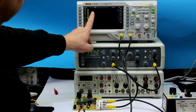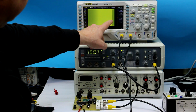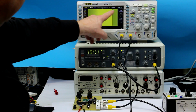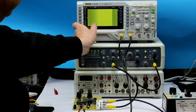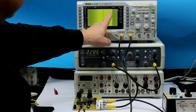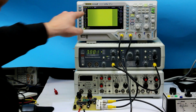And so now I've set the horizontal time to 1 second per division and put the trigger point just to the left so that we have 12 seconds. And of course now you can only see just the peak level of our frequency, because the sine signal is of course compressed here totally. But now you can also do a little trick when you use the math function and set the y-axis to a logarithmic scale. You can already have a dB scale, and the upper part will give you your frequency response.